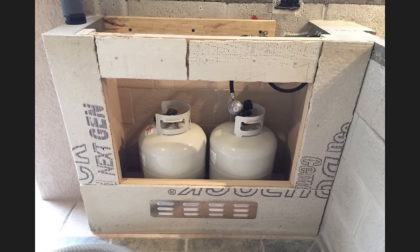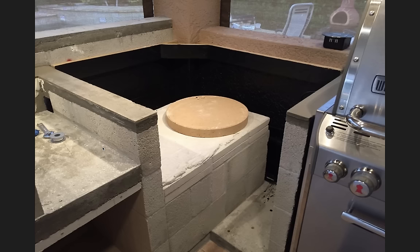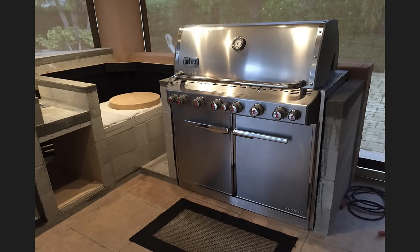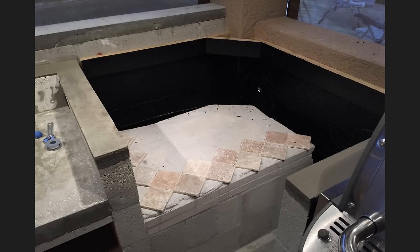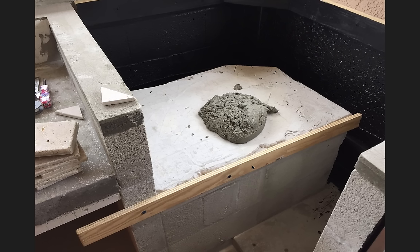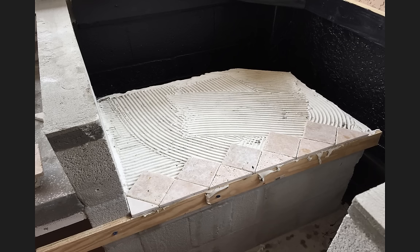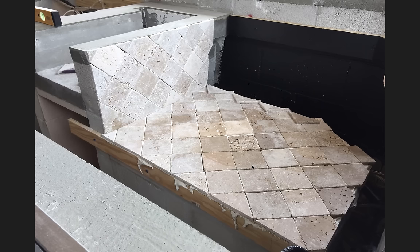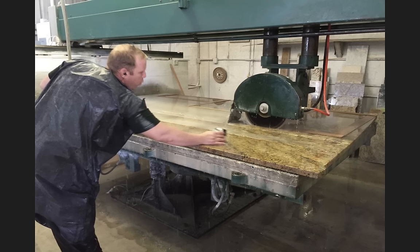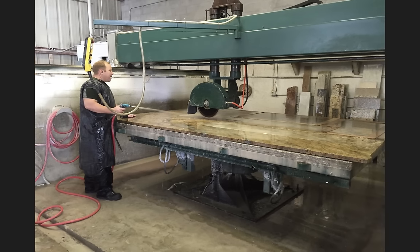Here's the inside of the gas area, and here's the finished placement of the egg. You can see the original slab and then the new slab — I used a thinner concrete mix in order to not have it crack, which is why it's a different color. Here I started to lay the travertine up under the egg because once the granite went in, I knew I would not be able to do that. This is just a leveling board that I rested the edges of the travertine on, and that kept everything perfectly level. Here I'm pretty much done with that base. Here's the granite company cutting out all the templates from my slab — it's pretty cool, I've never seen that before.